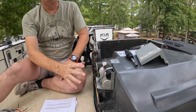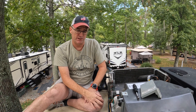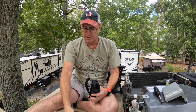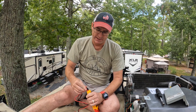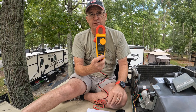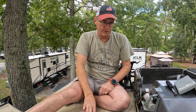Now, here are your capacitors. This is your run capacitor. This is your start capacitor. What you want to do is you want to basically short those out. Best way to do that is with your multimeter. We're going to put our leads on and then go terminal to terminal to terminal, and that will de-energize these. We're going to put our voltmeter to volts AC.